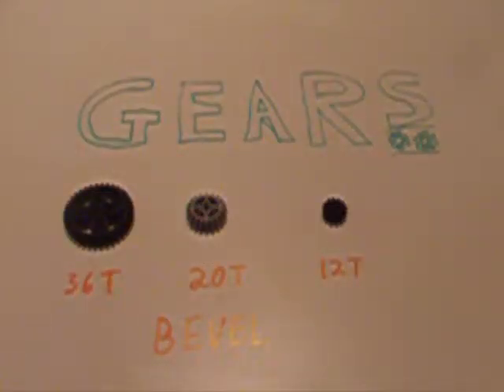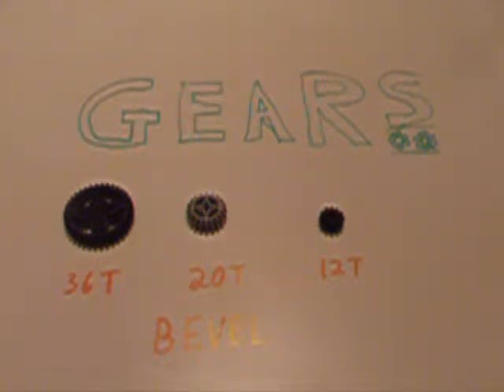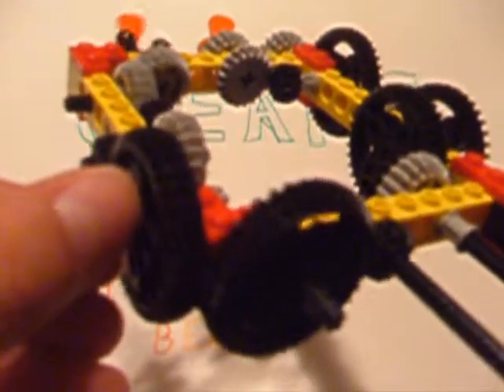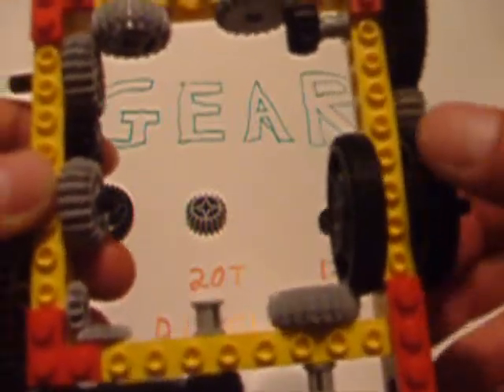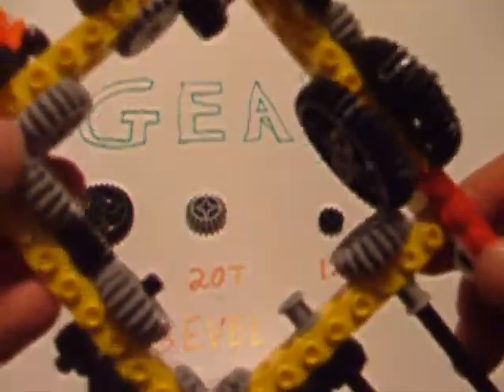But why is it important to have all these sizes, since the crown gear seems to work very nicely? Well, the best part of bevel gears is that they can fit in small spaces, like the 12-tooth gear. And they can also make a powerful gear train — you can gear up and down with them at an angle. Let's take a look at a little model I made to demonstrate all the various uses of the bevel gear. Bevel gears change and redirect motion, so they can be used on both the outside of a beam or on the inside of a beam to redirect motion. However, they can also be used in a normal straight gear train.